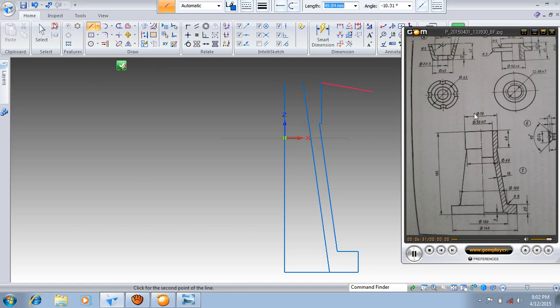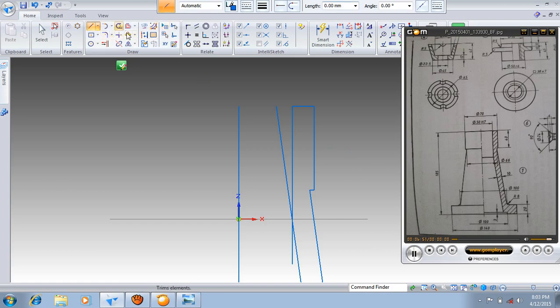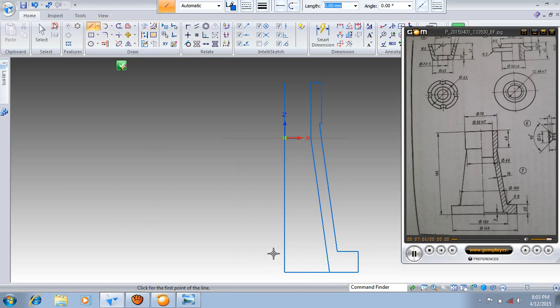The thickness is 10 mm, or 70 minus 50, that is 20. So half of 20 is 10 mm. I will draw, and I will just extend this line up to here where it intersects, and you can trim the undesired lines. Okay, fit to the screen. This completes our basic sketch,